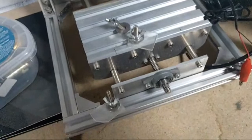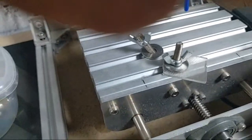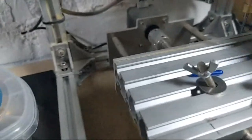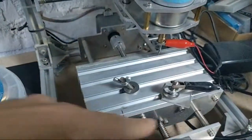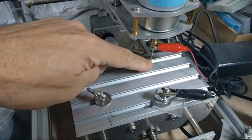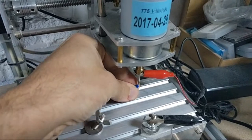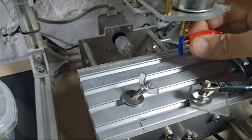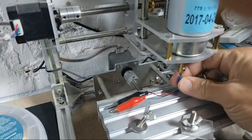these don't have auto leveling, by the way, or anything like that. But we could get auto leveling, because what I did is I wired into the Arduino on it an extra port on the GPIO, and you clip one of these on the bed somewhere just as a grounding point, and then you clip the other one on the end of your tool. So it would run along your piece of printed circuit board before your circuit board was going to be drilled, and it would touch it. And every time it would make an electrical contact between these two, it would register the Z-axis on that, and that would create a contour map. So then when it was actually doing the milling, it would deduct or add based on that contour map to whatever its current required Z-axis height would be. And that would give you your auto level on the actual print, well, effectively print, but the mill side.